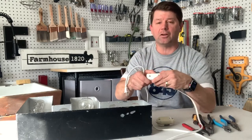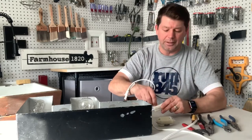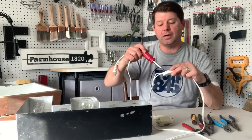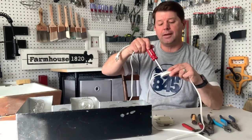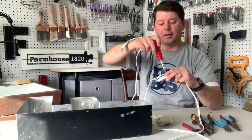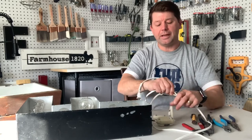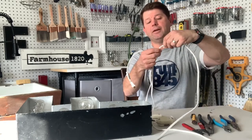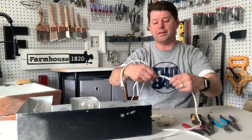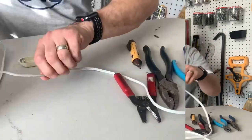When opening up the jacket for the switch, make sure you cut the hot end and wire that to the switch itself. We're going to remove the toggle switch we had in place and put the rotary dimmer on. We've already loosened the screws, so we'll take the two hot wires off and connect them to the rotary dimmer. You can use a razor blade and cut the wires in between, cutting about three inches off so it's preset for the wiring direction.